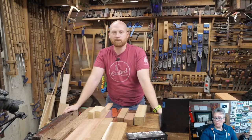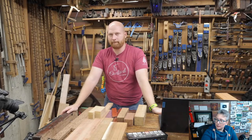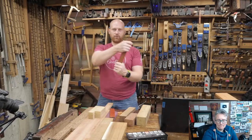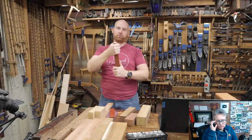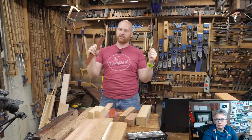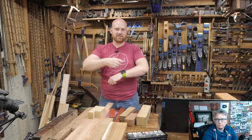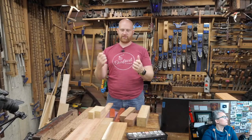Question: I just scored an old fro at a flea market and it needs a new handle. In my area maple, oak, and ash are common — which would you choose for a fro handle? With a fro you're going to have a lot of twisting force, so you want something that has a nice rigid form but also a little bit springy — it should bend a little rather than breaking. Oak and ash are very good for that. Hickory is generally considered the best because it has a really nice flexibility-to-hardness ratio. I would go with oak or ash over maple because maple tends to splinter easier and doesn't resist the twisting quite as much. Ring porous woods tend to be a lot stronger for handles because when you're prying and bending, they're a little stronger in that manner.